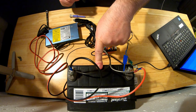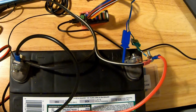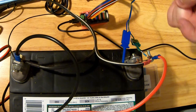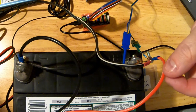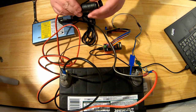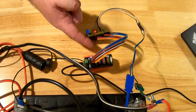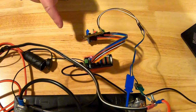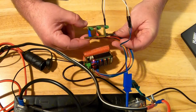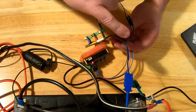I've set up a demo here using a battery borrowed from the lawn mower. Here's the shunt already set up with resistors off each side — it'll be much tidier in the production version. The battery is connected through the shunt to the other side, where I have two things connected: a battery charger connection and a cigarette lighter connection. The ESP32 is connected to the laptop, with three INA219 boards ready for my boat, and two lines connected to the battery terminals.